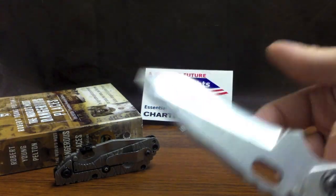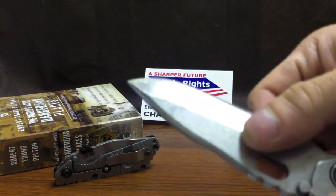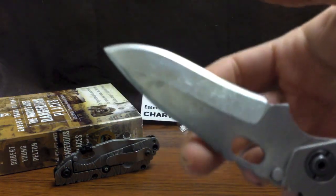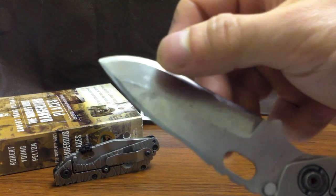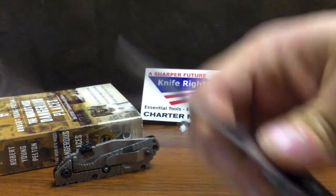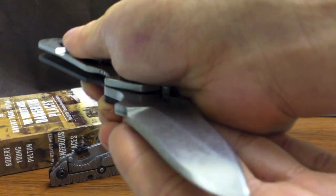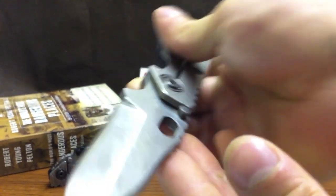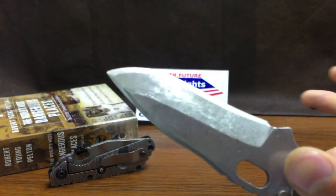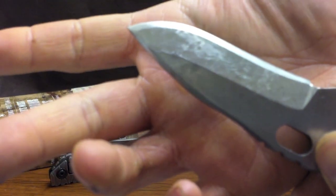And it comes chiseled. I knew right off the bat that's because it's too much effort to grind both sides down. And at the same time, this is one of the original older ones, with a large bevel right here. On the newer, later ones that he made, they still had this bevel, but the actual cutting edge was very, very narrow. Because, like I said, I've noticed as I take it to a fine, shallow grind for slicing, it does have chipping issues. And so that's my experience with tool steels: yeah, they chip easier than others, depending on what kind. If it's M4 or 3V and emphasizing toughness, then that's great. But on something emphasizing edge retention, like ZDP or this, it's just a constant battle.